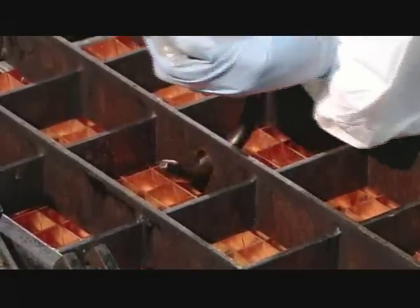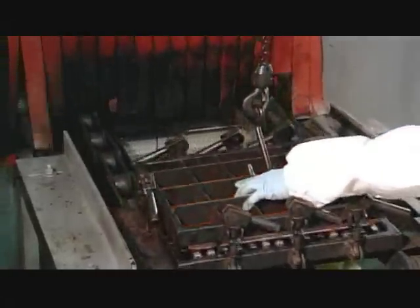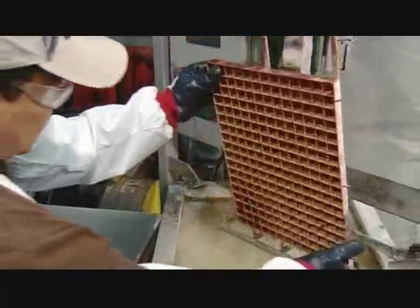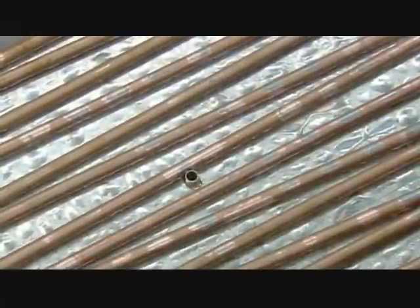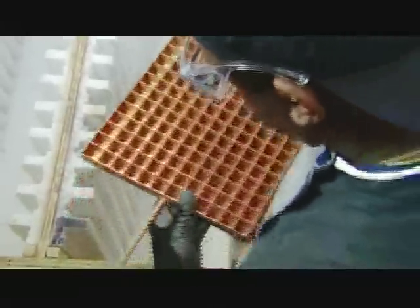He hoists the rig into an oven to melt the solder strips between the backplate and tubing, fusing the parts together. Then it's into an ultrasonic bath, where high-frequency sound waves clean off lingering contaminants. An inspector examines the evaporator to confirm that the parts have been solidly fused.